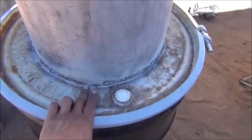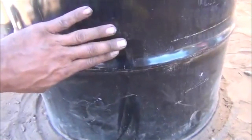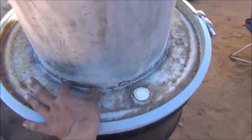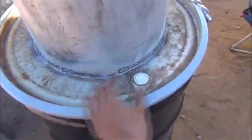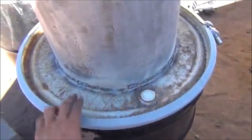Here's an update — we've got our whole cut in the top of the barrel and we've now set our whole reactor system all the way down in there. The bottom is right there — that's going to give us not a lot of distance at the bottom, still a foot or so for ash catch, but just enough room so the heat has to travel all the way back up to the top of the barrel and help keep that reactor nice and hot. A lot of this will be insulated around certain key areas. One key thing about welding this: do little sections — never try to weld all the way around on such thin steel, you'll warp it really bad. Take a little section, move all the way to the other side, do a four-post approach and work yourself around slowly, doing little sections at a time so you don't overheat and warp the metal.